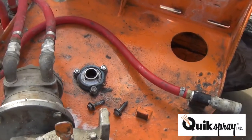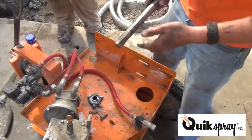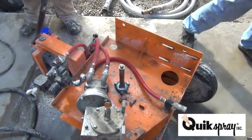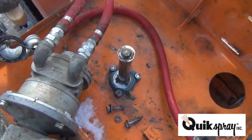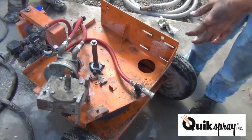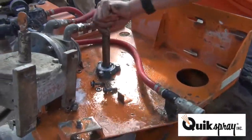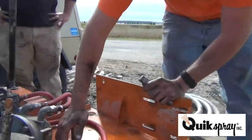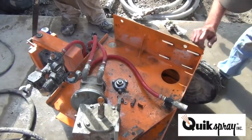Try using a saw, move them around. Any grease? I was using oil. Oil will work. The same thing's going to happen on the bottom as far as alignment of the two spacers. You put your finger up in there. Out comes your assembly shaft. You know everything's in a line. The shaft slides right through the guts. Give it a little persuasion. And there you have it.